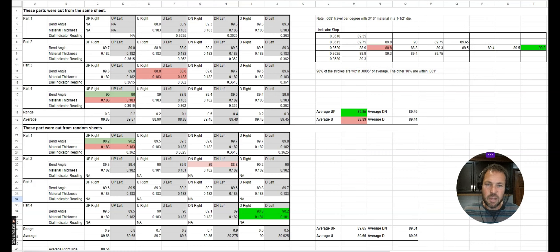Steel, to a much lesser extent, has some of the same nature and characteristics because of the way it's been produced and rolled out. We did manage to find the grain in this sheet of steel, and you can see that here. Now this is not an accuracy test or repeatability test of the machine. We did give you the indicator readings showing exactly where the machine stopped, but this also included the deflection and tonnage differences from the different plates of steel that all bent slightly differently.